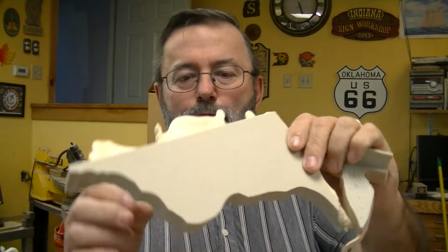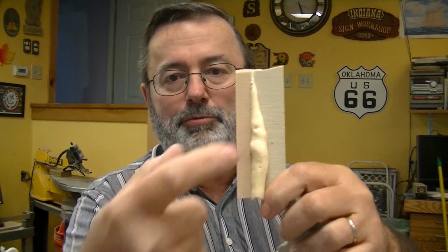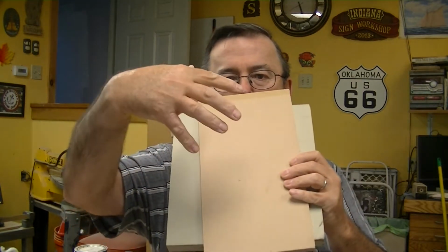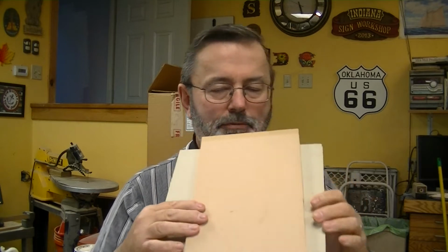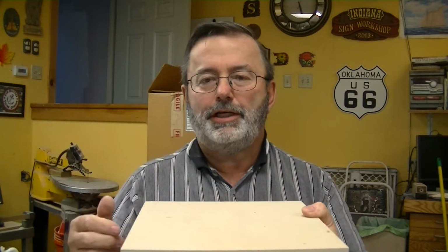You've got to put clamps on it, otherwise the thinner layer, because I used up some of the 10-pound stuff that I had left over, and I just glued that together with the 15-pound because it's not that much difference. But what happens is, because this is thin and I had pieces that were 10 by 12 or 13 inches in the middle of the panel, it kind of bowed out a little bit. So you have to put clamps all the way across to try to control that bow. Doesn't matter that much, because what I did on the CNC machine is I just ran my cutter across and flattened it out, and then flipped it over, and then just started doing my machining on this side. So I had nice and flat on the back, and I get my machining on the top. Worked okay.